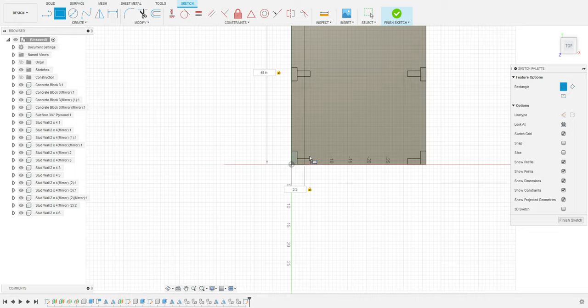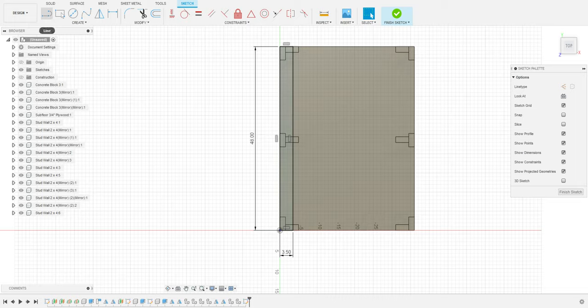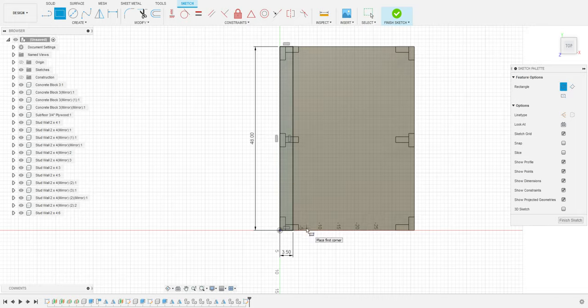Now on the roof that I'm about to build here in a minute, I would probably just attach it with some metal clips, like Simpson clips, or like you would use typically on a house for windstorm, if you had that in your area. We do have that down in the south near the Gulf. That's very popular to use strapping from a company called Simpson to get everything tied down pretty good in the event of wind. But on a lot of doghouses, the roof is just movable.